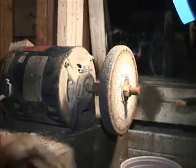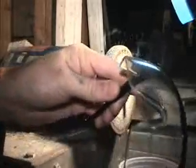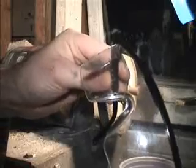Before you start grinding, always wear safety glasses. Hot metal will be flying at you, and the angle you want to look at in order to cut your picks properly will require you to stare almost directly in the line of sparks. Always wear safety glasses, regardless.